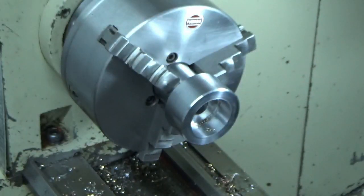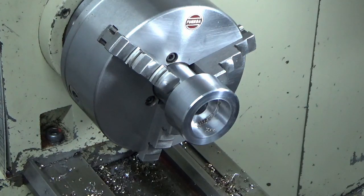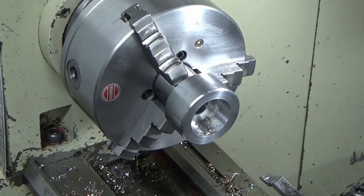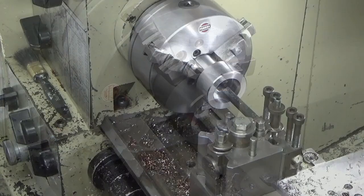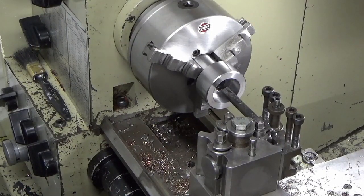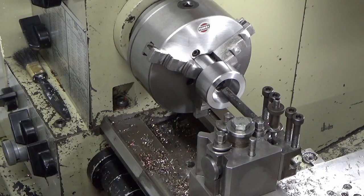Same as before, I'm just using a vernier for now, so we get closer. So on about 18.2 there at the minute. So you get the idea. I'll bring you back when we get near finished size. So according to the last measurement I've taken, I've 10 thou left to come out, and I've been taking 10 thou cuts. So every time I've taken a 10 thou cut, it's actually cut off what I've put on,